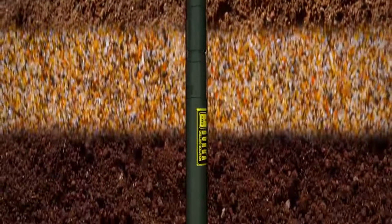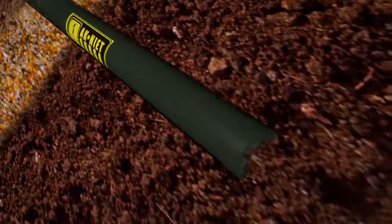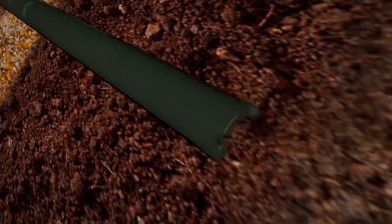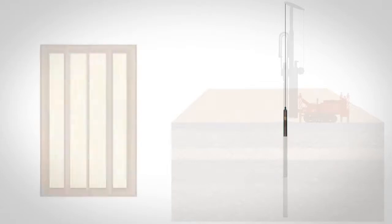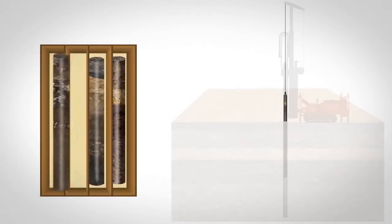Core drilling, also called diamond drilling, is a type of fast rotation drilling, the implementation of which results in the destruction of the rock within a ring pattern, but not over the entire bottom hole. In this mode of drilling, the interior of the rock in the form of core — a rock pile with an undisturbed structure — is fully preserved. For this purpose, the core is periodically locked and isolated from the bottom and lifted up to the surface using a core receiver suspended on a rope, from which the core is removed and distributed to core boxes.